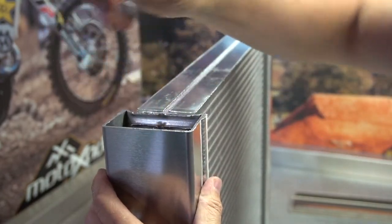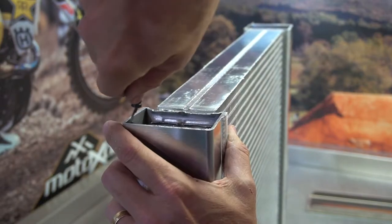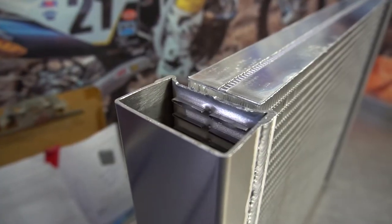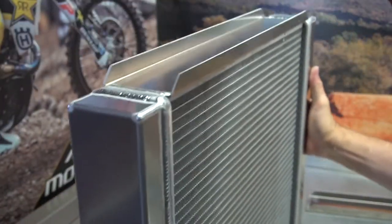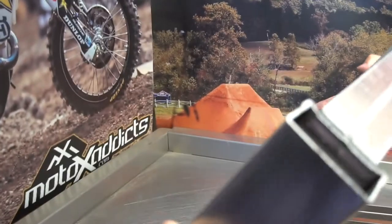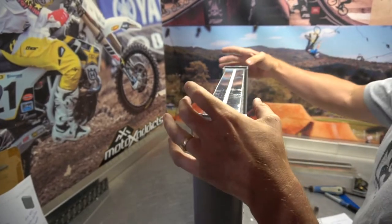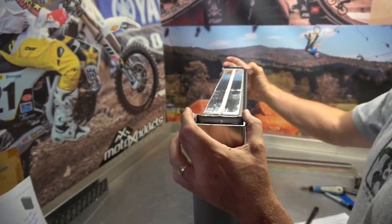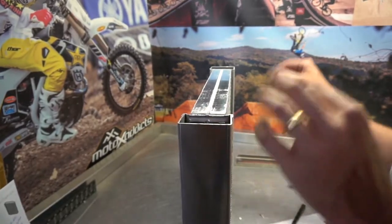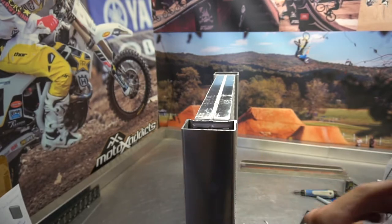Debur, and make sure you get all the material out of the inside — blow it out with an air nozzle. Now, you can either make new patches to go over the ends, or you can salvage the patches that you cut off from the end of the tank and put those back on. In our case, we're going to fabricate new ones, and I'm going to show you how to do that.